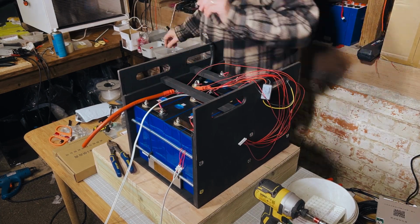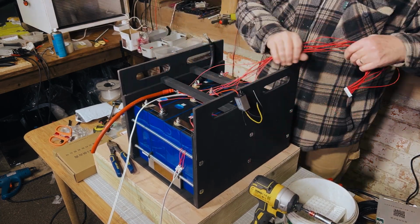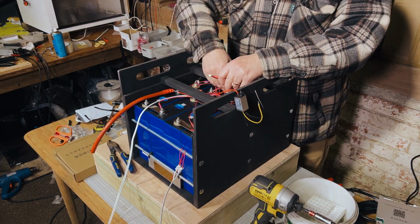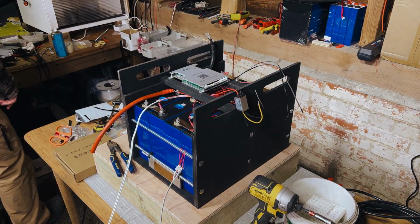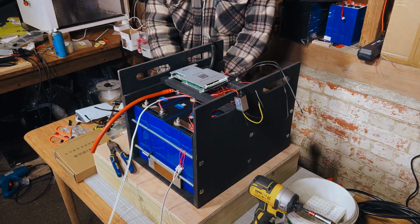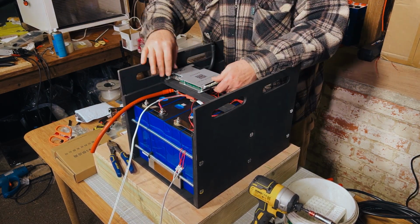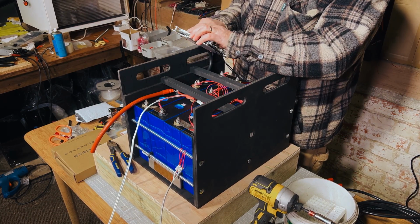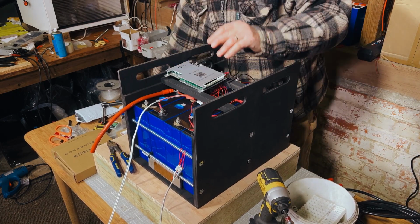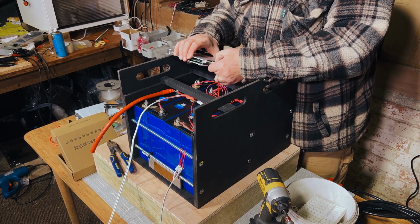We usually will put everything down, check everything, tighten it all up, torque it up, and then we'll usually just double check everything, go back over all of the bolts, all of the nuts on the terminals, and just double check again a second time that they are torqued correctly, because often this is an area that mistakes are made. If you leave one of the terminals that's not torqued correctly, that can be a real point of pain in terms of trying to debug things and figure things out, and also it can be an area of heat buildup if you don't torque correctly.